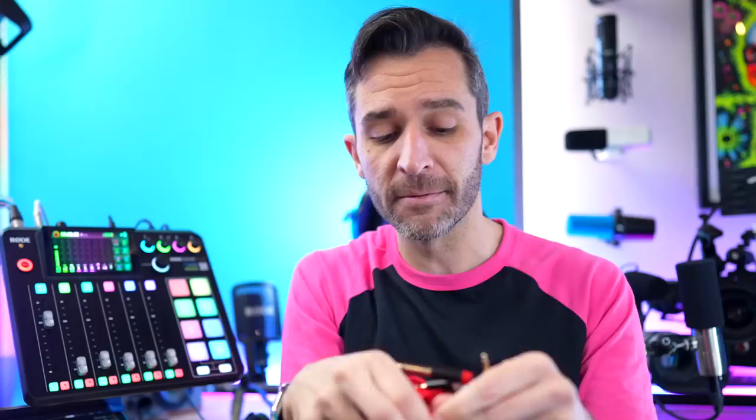The tricky part, unfortunately, is that not all cables are created equal, and that's why I've waited so long to make this video. I've literally spent the past 4 years since I originally got the first RODECaster Pro trying to find a reliable solution to this problem, and this is as close as I've gotten. Things get very tricky because this Y cable ¼ inch to 3.5mm and this other Y cable ¼ inch to 3.5mm have the exact same specs, were even the same price, and everything about them should be exactly the same — but they don't work the same. This red cable, as cool as it looks, does not work. It does what most cables do and introduces a ton of noise and interference.